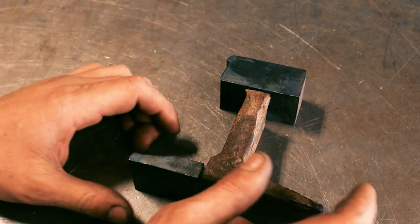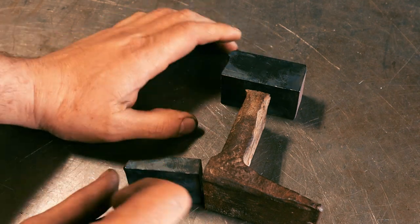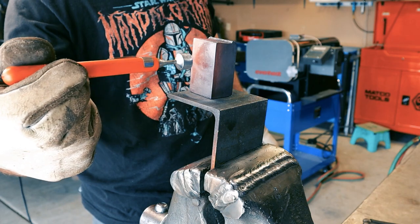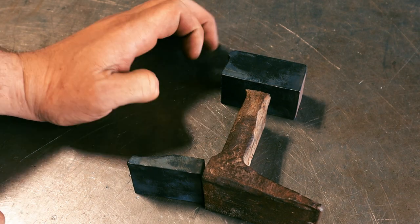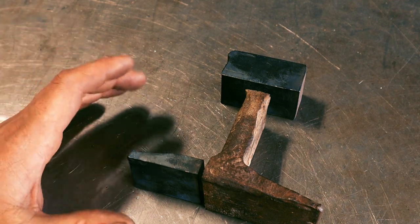in your home shop. So what I've done, you can see where I cut these sections off, and I've annealed them all the way. I heated them up with a torch till they were cherry red and non-magnetic, and then I let them cool down slowly at room temperature. And right now, it's registering on the Rockwell scale at 30C.